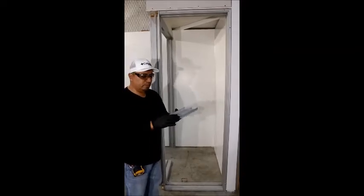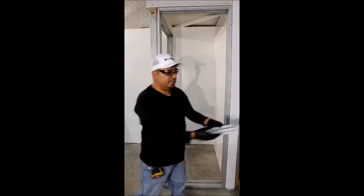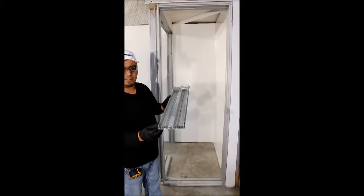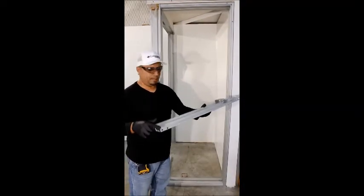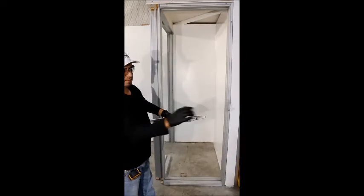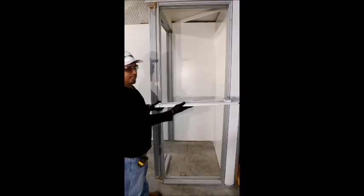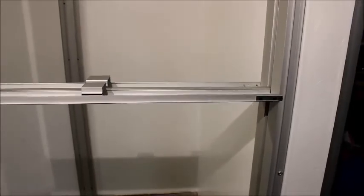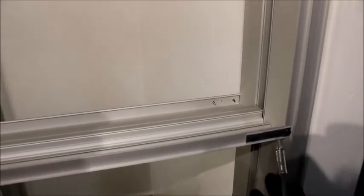Mark your location for your horizontal end install and opening. The removable glass stops will be facing the top of the window. Attach the end to the glass jamb with the RA107 clips just like you did at the base. Install with the three screws provided. The other side you will install using the DES RA102 clip and the four screws provided. This clip is installed inside the horizontal mullion and attached with two screws to the mullion and two screws to the corner post as shown. Repeat with the other clip on the other side.